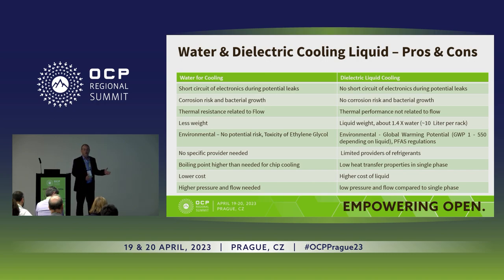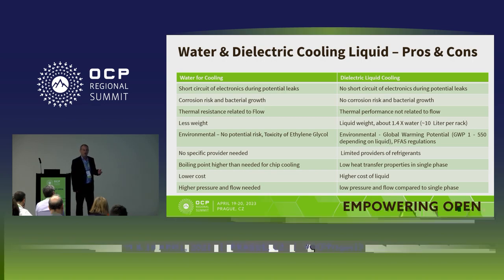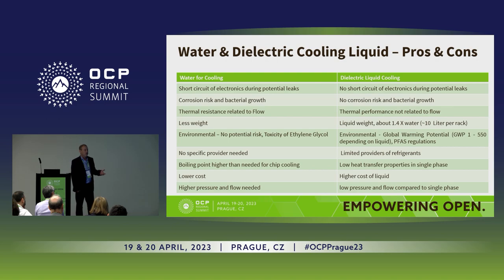Our company was using a liquid from 3M called Novec 7000 that had a global warming potential of 500. Now we're moving to a different company, Opteon, that has a global warming potential of only 2. A new regulation is coming in for PFAS, so we're working with these providers to supply PFAS-free liquids. By 2026, when the regulation is in effect, we're expecting all systems to move to PFAS-free, using different combinations of chemicals to get there.